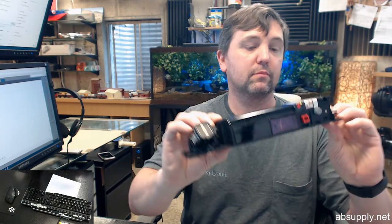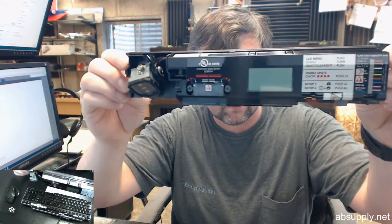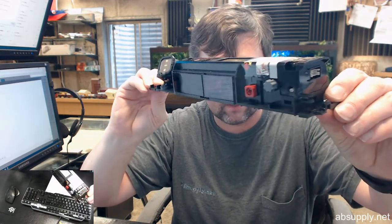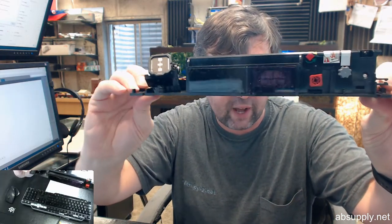This is the body. The IO is an easy to install all-in-one sensor that maximizes safety and activation. Lots of settings — you're going to have your microwave sensor here, your infrared down below. The microwave is going to sense the pattern in front of the door. The infrared comes down as a curtain in the plane of the door, meaning that as you approach the door opens via the microwave, but when you are in the space the infrared is picking you up and will prevent the doors from coming in and making contact with you, so it's a smart sort of sensor.